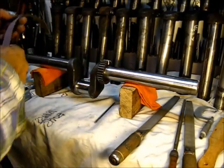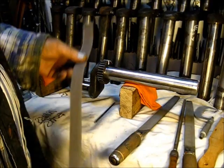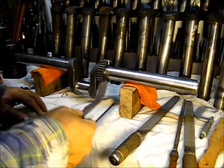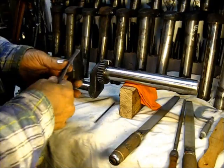The thing to do is to buy a good quality emery paper. Some of the cheap stuff is as bad as the cheap sandpaper. But a good quality emery cloth, crocus cloth — a good quality.